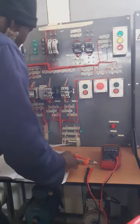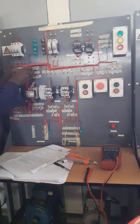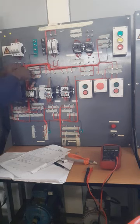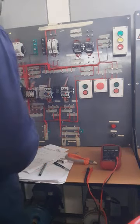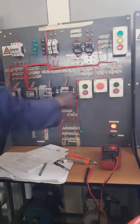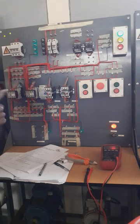Because you must press Motor 1 first to run, then Motor 2 will run. Let us confirm that. Let me fix it quickly. So we confirm: I switch it on, then I press Motor 1 — nothing. Then I press Motor 2 — nothing. It's not running — correct according to the statement. Then I press Motor 1 — it's running. Then I press Motor 2 — it's running now.